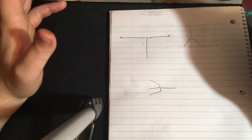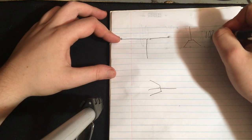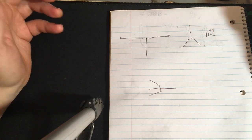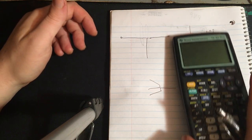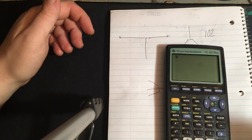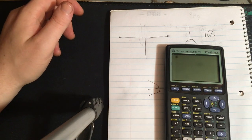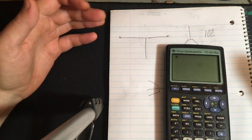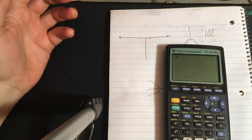So, why are steel whips 102 inches? You hear that a lot. Why 102? Well, I don't know the velocity factor of steel, the spring steel that they used, but let's go ahead and pretend like we're going to do this for the first time. All right, so we first take the speed of light, which is 300 million, but since we're dealing with megahertz, we don't have to worry about adding all those zeros. Like 1 million divided by 1 million is 1, the same as 1 divided by 1. So we're dealing with millions, we can use 300.